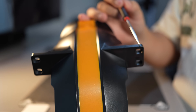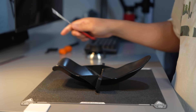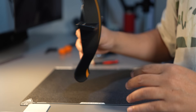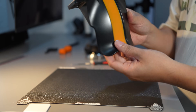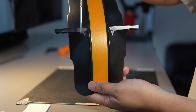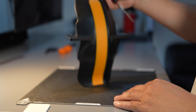At first I thought that I will add a plane here so that I can print in this direction. But when I take a closer look at the geometry, if I print in this direction it would be better because the curve profiles will land in the XY direction. So it will give a better print quality if I print in this orientation.